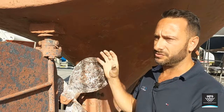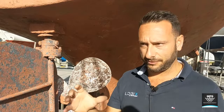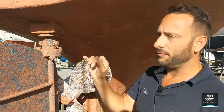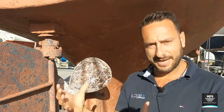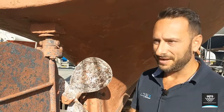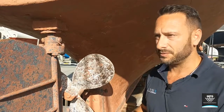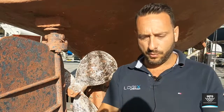A timber boat of this sort has an international standard of between 550 and 600 millivolts. A zinc anode creates up to one volt, so by over-anoding the situation it will actually get between your stern tubes, your rudder tubes, and all these different metallic components and actually start dissolving your timber. It is a very distinct problem, and it'll always happen — the more water movement you have, the more problems you will see.